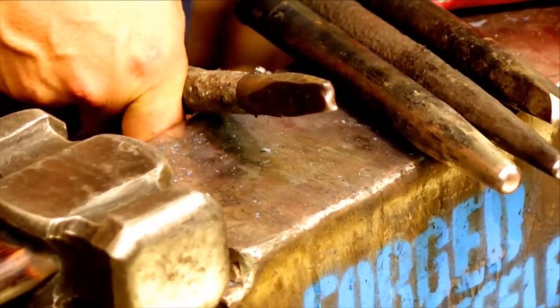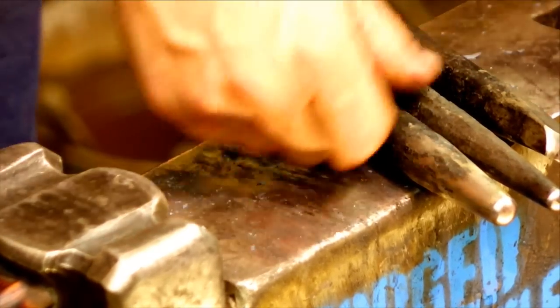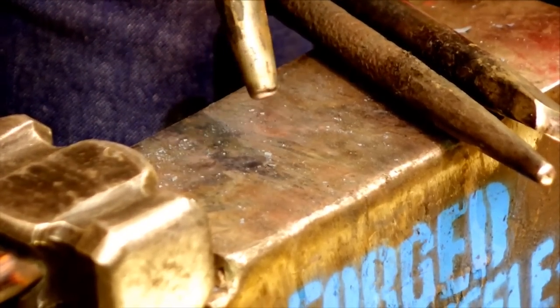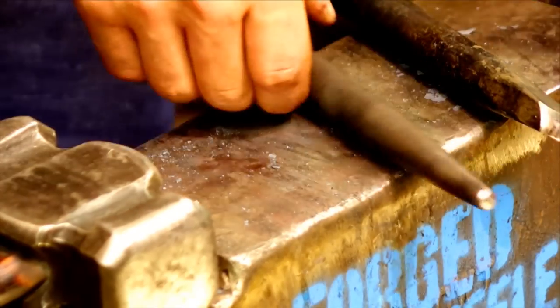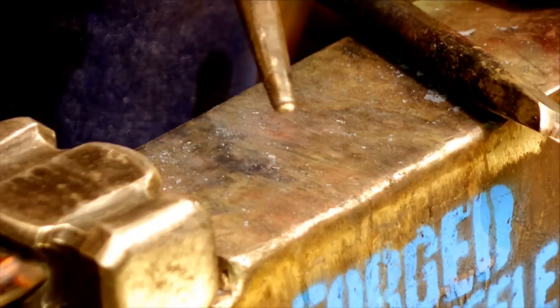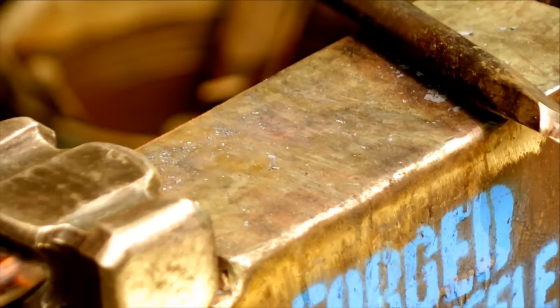This is simply filed out of a piece of coil spring that has a rectangular taper on it. We then used a smaller ball fuller with a diameter of about 1/2 inch. You can see the radius like that. It's not a semicircle, not a semi-sphere, not a half sphere. Hemisphere? I believe hemisphere would be the term. Neither is this. They're more squashed-out balls, and this is about a 3/8 inch diameter ball fuller.